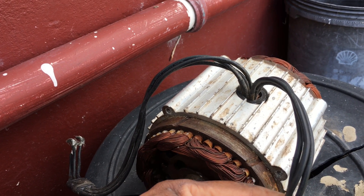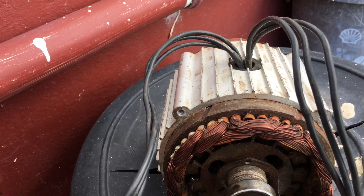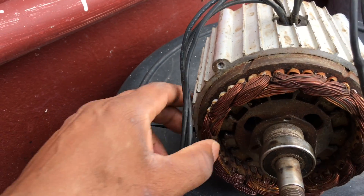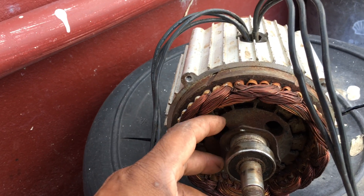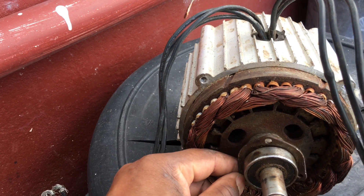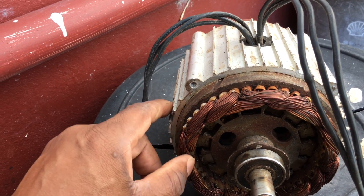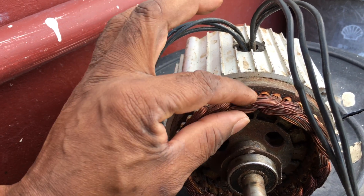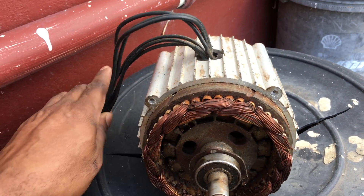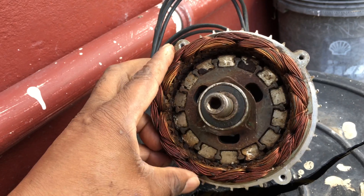Those phases feed into the rectifier. This is a 24/48-volt circuit, and eventually I think I'm going to go up to the 48/96-volt version and connect it in series to see if I can get more voltage. I'd like to generate more power at a lower revolution, and I believe that will happen — I'm not sure if the 48/96 model will have more copper windings, but I'll wait and see.